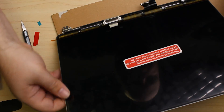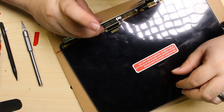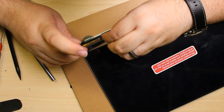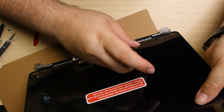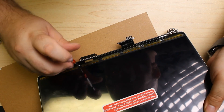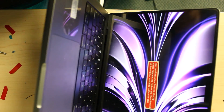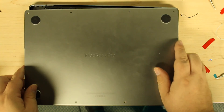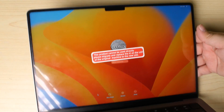If you're having issues with it sitting flush at the bottom — like if it feels like it's sitting on something — you might have the bracket installed a little too high. Make sure it is following the same position as the original panel. We'll put all the screws back the same way we took them out, reinstall the little brackets and the bezel piece at the bottom. And there we go — you can see it's now working again: no damaged display, no shadow at the top. We'll reinstall the back and there you go.